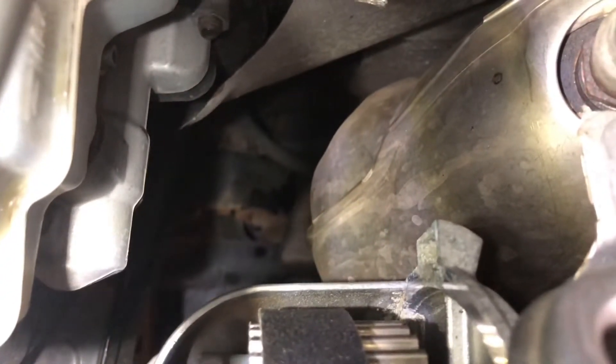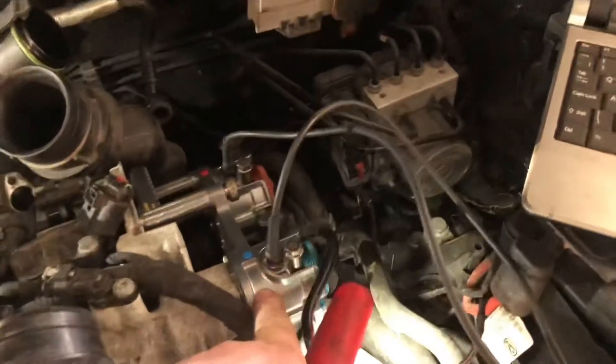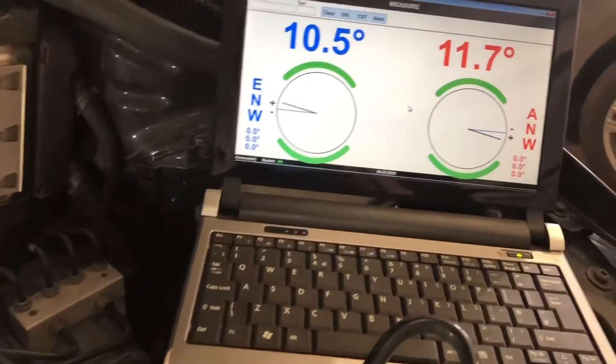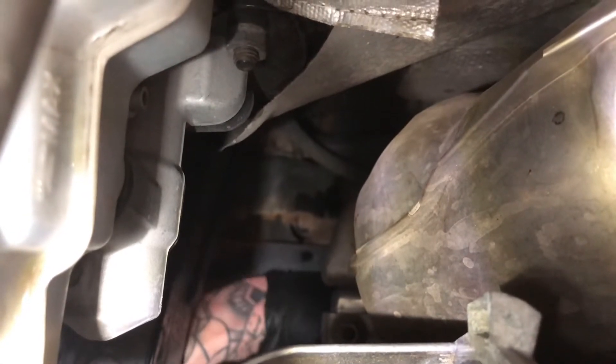Once his hand dives out of the way we'll see. You've seen an engine be turned over before — it's only got a big flat on the crank down there. We're just going to watch it on the screen — this is a visual representation of the whole turn. If you hear him shout, he's probably straining because compression has taken over. We do the nominal amount of turns — we should turn it over twice by hand. Now the pin's going back in and he's going to crank it over again just until it sits on that lock.